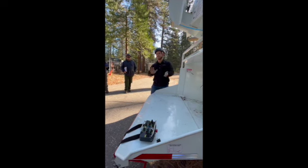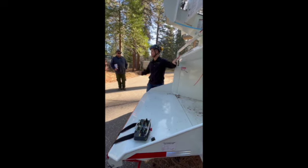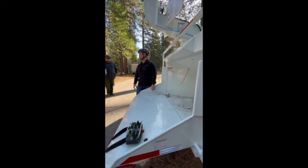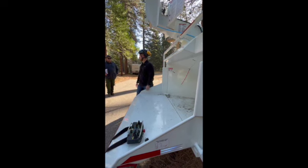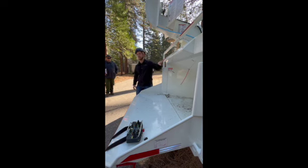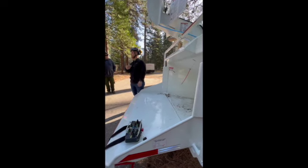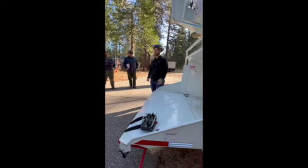Obviously, guys, that knife right now, if we ran our hand across it, it'd slice our hand open. If you can run your hand along a knife, your knife is shot. You need to flip it right away. We've gotten calls where machines have 2 hours on them and guys are saying, I want my money back, this machine's not performing like it should. The first question we ask: are your knives good? Yes. We get out there, and we could do this on the knife. That's not a good knife. It's trying to cut wood. As soon as you let dull knives on this machine, you just turn this chipper into a chunker, to where it's just hammering that wood. You're putting a lot of stress on this machine and those knife bolts.